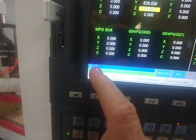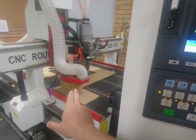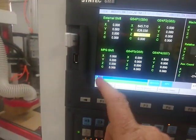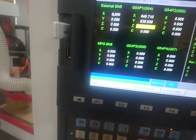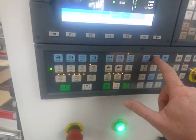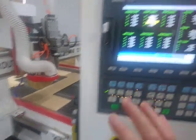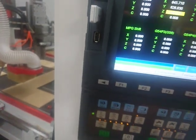Let's go back to our arrow here — we're going to use our down arrow and type in that number: 10.177. You'll see it's come up down here. Remember, this is just the difference between what our tool had for the Z auto height and what our measured MDF height is. We've calculated the difference is 10.177. We press enter and you'll see it's up here now — the machine Z height is calibrated. We can back that off using the Z button, go back to jog and Z to bring that away, then turn off the vacuum pump. That is our Z calibration done and dusted.